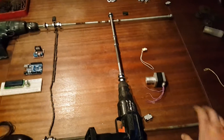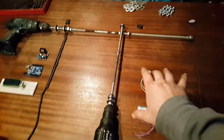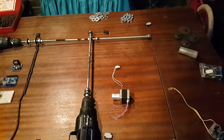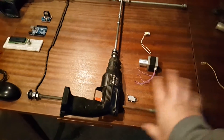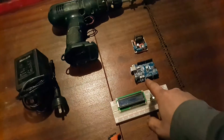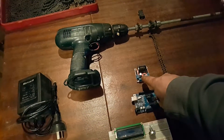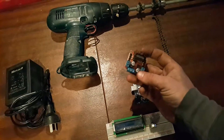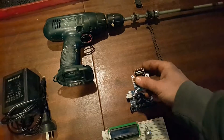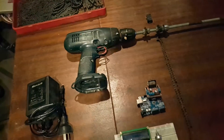For this idea, it's all right. All I have to do is change the limit switches to something a lot bigger, but this size will do for now. We'll be using an Arduino Uno that'll control a motor controller — this one here can control two DC motors. I'm not sure how it's going to cope with running 12 volts through it and then to the drills.